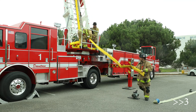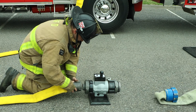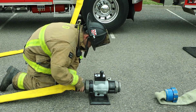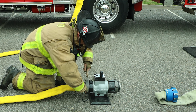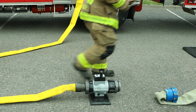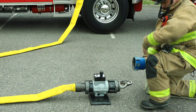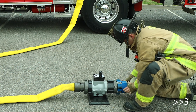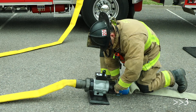Connect a three-inch hose to the four-inch to two-and-a-half-inch waterway gate valve placed on the ground near the pedestal of the TDA. There is an additional 25-foot section of three-inch waterway hose that can be utilized as needed. Consider the routing of your three-inch hose to allow for elongation and movement when charged with water. Avoid hose or coupling binding, damaging the railings, floodlights, and body of the apparatus as the hose is moved or charged. Ensure the four-inch supply line has been connected to the closed waterway gate valve and all master stream couplings are spanner tight.